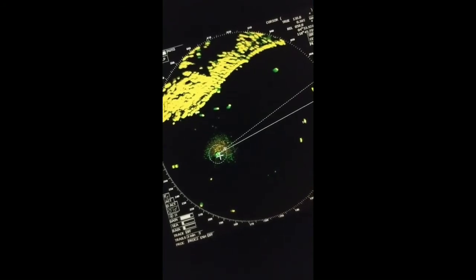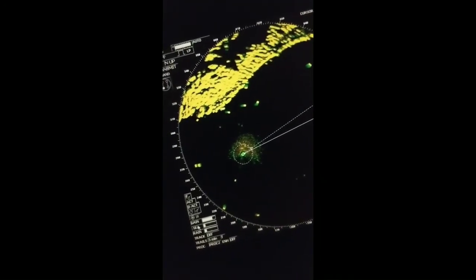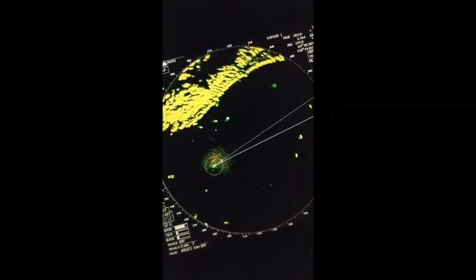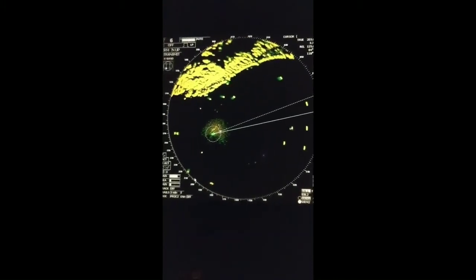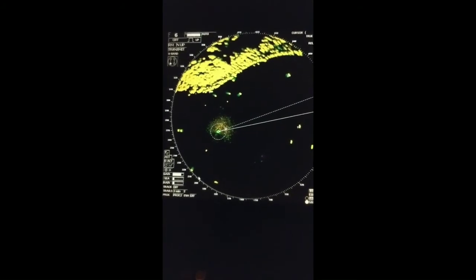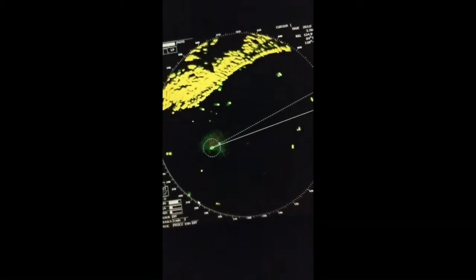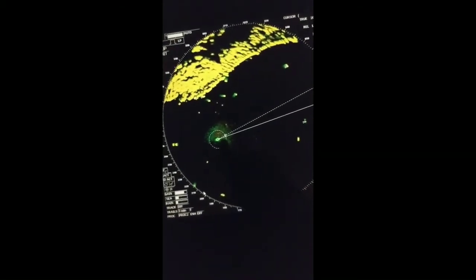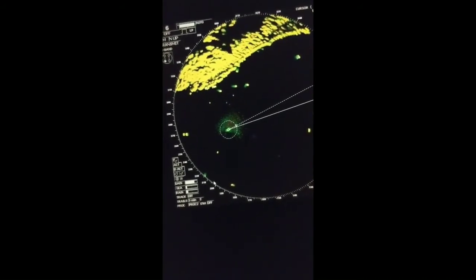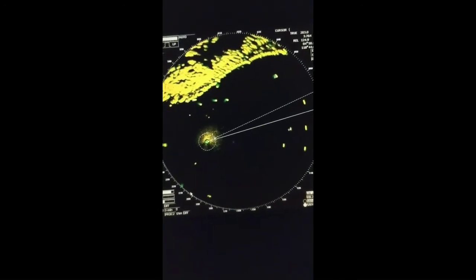The sparkle background is the reference — you can also see the scanner moving. Sea clutter (C) is used in bad weather when waves and sea crests create noise in the targets and you may miss actual targets. Increasing sea clutter reduces that noise around the vessel. Since the weather is currently very calm — almost like pond water — sea clutter should be switched back to zero.